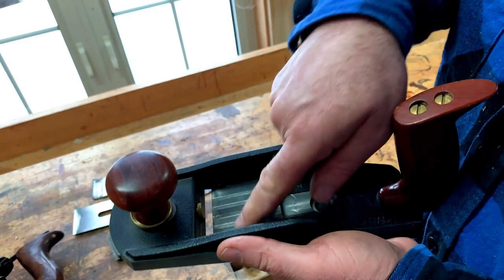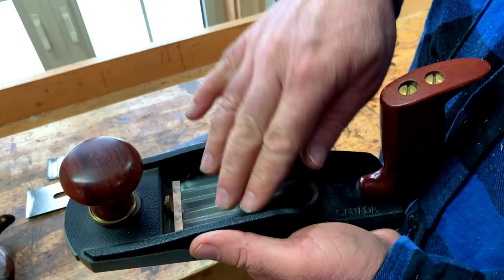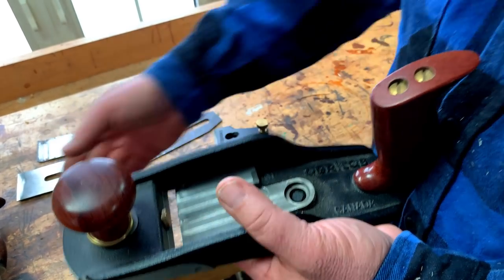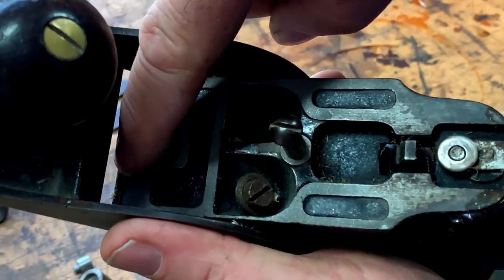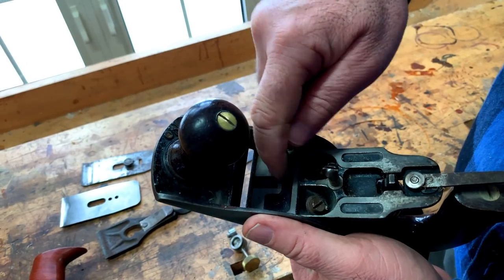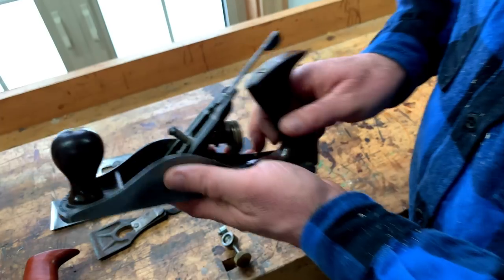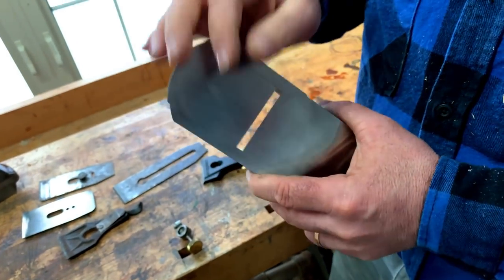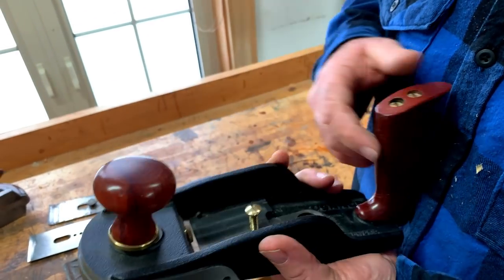It's one thing to have a blade that's rigid, but the blade has to be fully supported by the body of the plane as well — otherwise it's still going to chatter. Look at all the support surface here. No nonsense. Flat. The whole area supports that plane iron. The older plane is pretty good — you've seen it perform — but here the surface is not continuous; it's just around the perimeter for holding the plane iron. So we've actually got a new hand tool that's way better than in the olden days, which is something you don't often see.